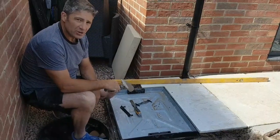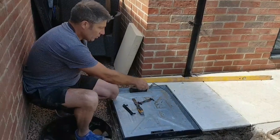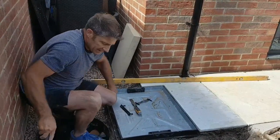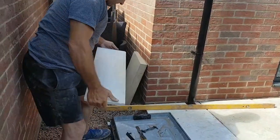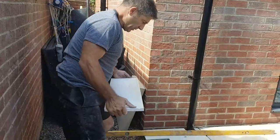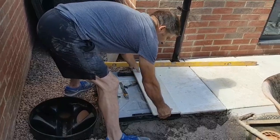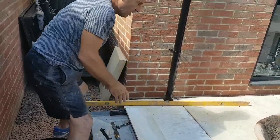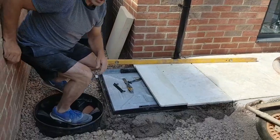The reason for an inspection tray is it allows you to pave through those manhole positions and you get rid of all those visible manholes in your garden. Yes, you're going to have a line where your manhole is, but what's going to happen here — some of you DIYers out there will understand this — is that this is going to be cut and go in there.